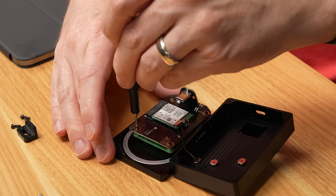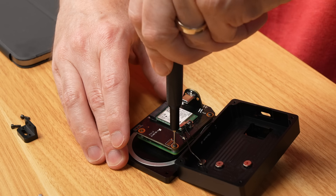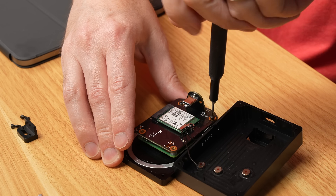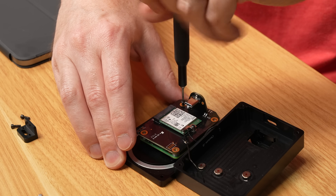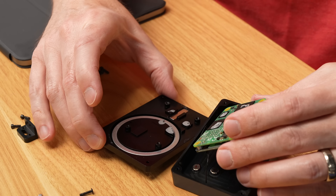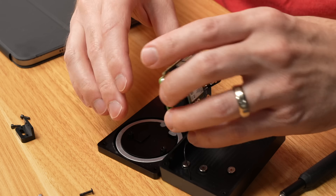So I took it apart. You can see that on top there's the Wi-Fi chip and it has two antennas kind of stuck on the sides of the case. I don't know exactly how they're getting the signal through because the case is metal, but Wi-Fi RF is always magic — maybe there's a little magic going on in there. They have a couple of magnets that hold the spectrum analyzer on the back, and a big magnet ring that holds it to MagSafe phones like the iPhone. Underneath the PCB there's the Raspberry Pi Compute Module 4. I think if they did a Compute Module 5 it might not have enough power, since that requires two to five watts plus more. Basically it's a little Linux computer inside the box that does the spectrum analysis, sends data back, and gets all the Wi-Fi channel information. The magic is the software that translates the Wi-Fi stuff through Linux into the displays you get in all the apps.